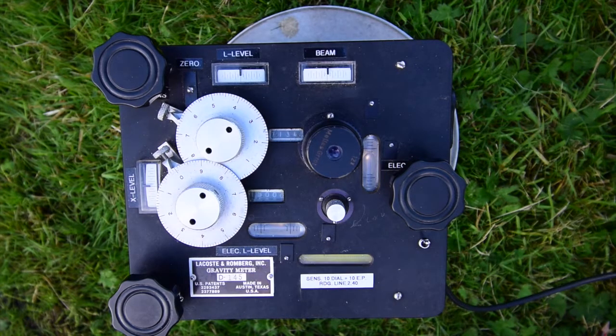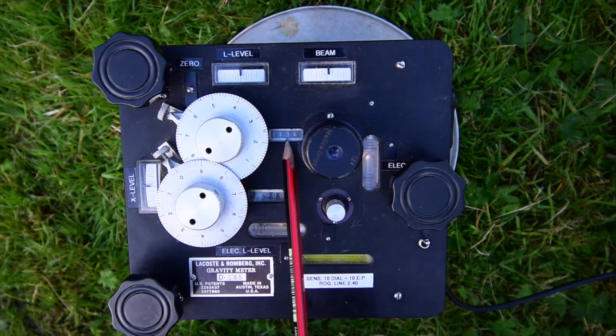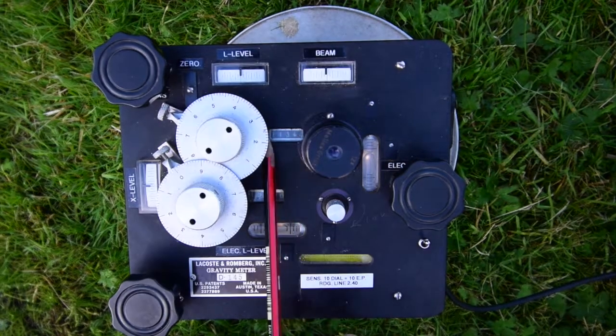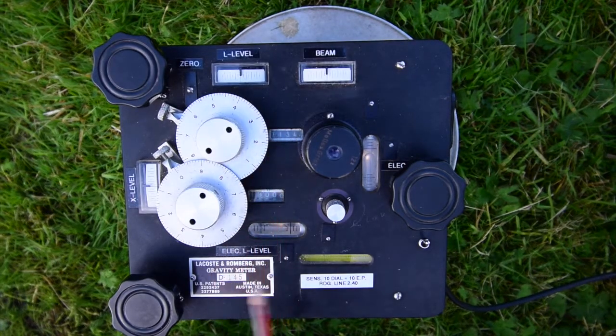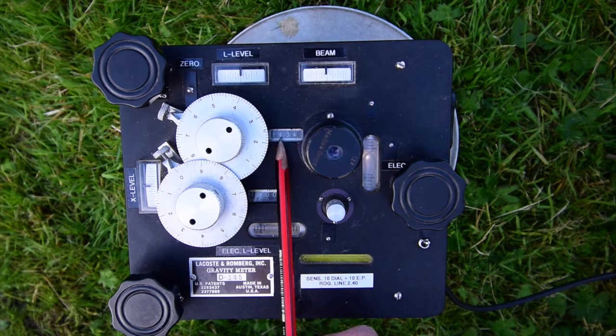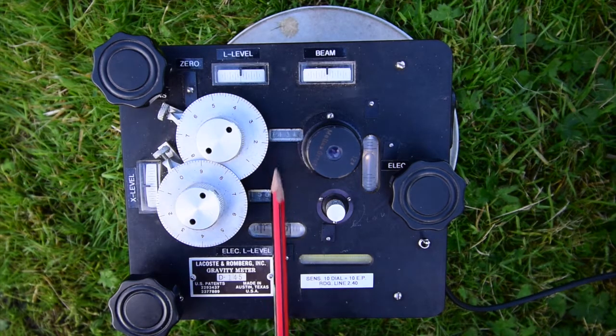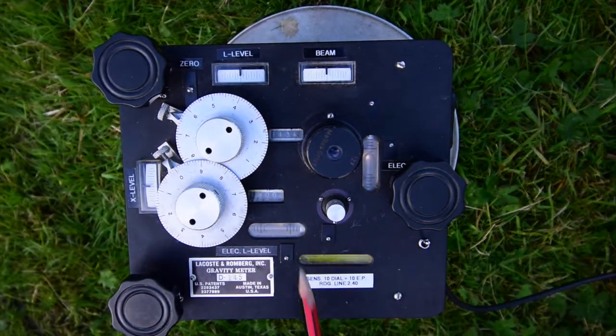So now we can actually write down the answer. To do this, the first thing we write down is the numbers in this little counter here, which looks like the mileometer on a car. And what it's counting is the number of turns of the dial from the beginning of the screw thread. Right now it says 71347, and that's 7,134 dial turns.